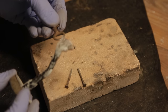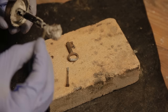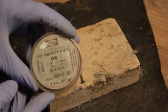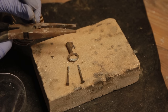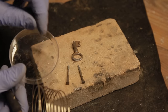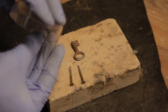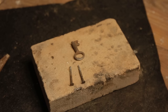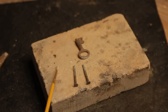I put a little bit of flux on the key at the bottom, and then I put a little bit on the nails which are going to become the legs for the character. Now I'm going to take my silver solder and cut off just the pieces that I need. I prefer to do it this way because I tend to use less solder when I go ahead and prepare the exact piece I'm going to use — and you can see it's a tiny little piece. I cut another one, just to show you how very little solder is required to do these kind of joints. Then I take a little brush and apply just a bit of flux to my silver solder as well.